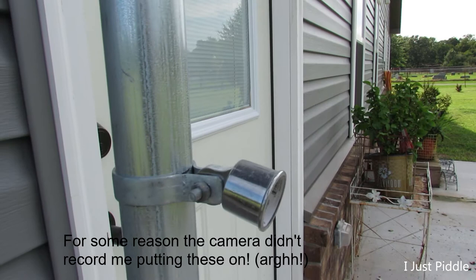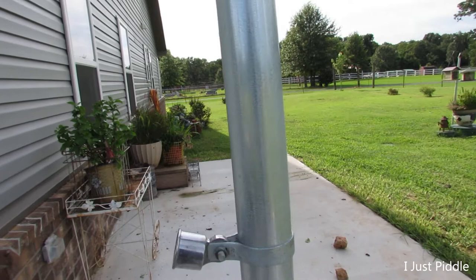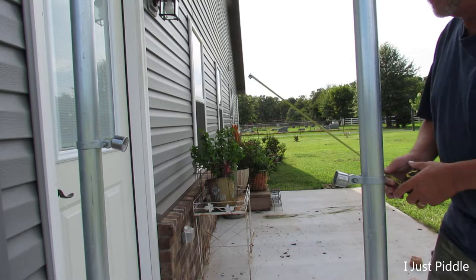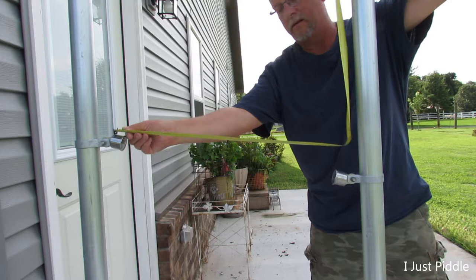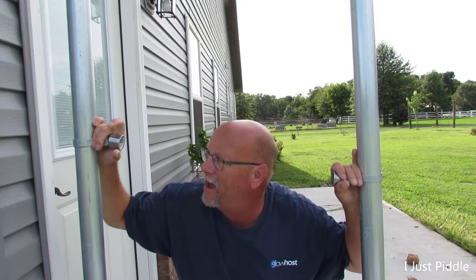As you can see here, I took one of those bands and put it around this post here, and put in one of those — kind of like a socket, a little keeper. Put one in there, then I put one over here on this side. Now I need to take that and measure the distance in between it so I can cut that post over there to be the handrail. 25 inches. So I'll get that top rail over there and I'll cut it to 25 inches, then come back and try to wedge it in between these right here to make a handrail.